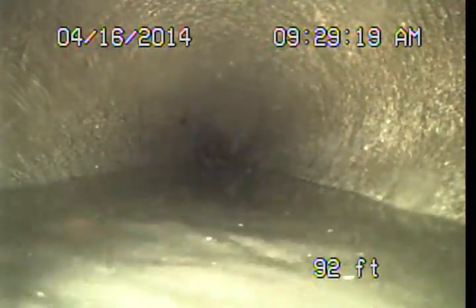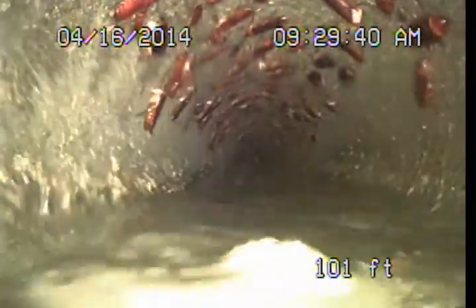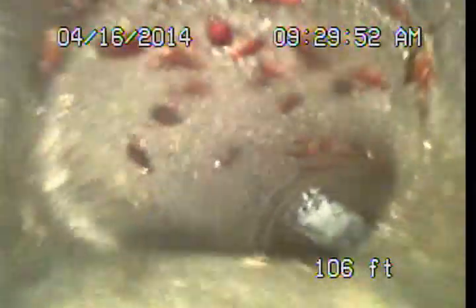The one thing about the concrete piping, though, is here in the city of LA, the local building department is requiring rehabilitation of these older concrete pipes in the event of certain types of construction done on the property, and that's done by a lining system at the property owner's expense. I don't see anything significantly cracked or broken, so it's basically a functional system.